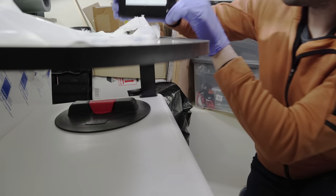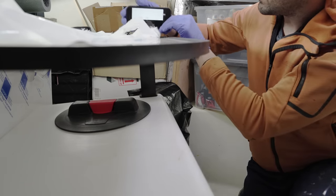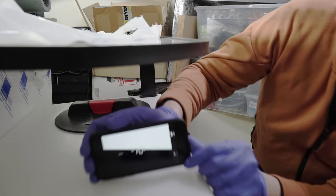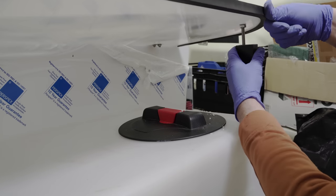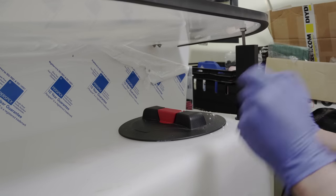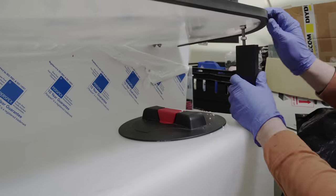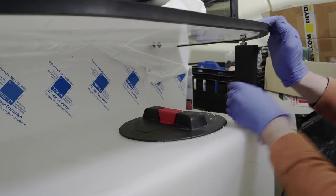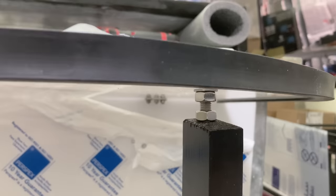That said, I'm not setting up the wooden supports at just one length, because what if the water tank sags, or expands due to heat, the way it's bedded in, or some other unknown unknown? So I'm making the supports adjustable by about an inch or so. We'll see how that goes. Screws make useful testing instruments for slants or angles. Using a pair of nuts underneath the worktop seems to do the job, but I might need to fiddle with the design a bit. Worktop flat. We're making indefatigable progress aboard Alan.